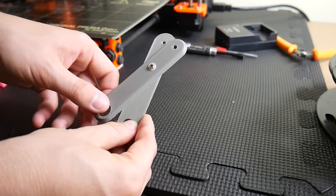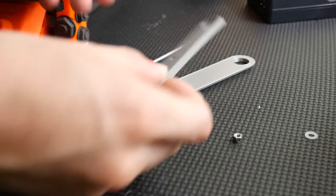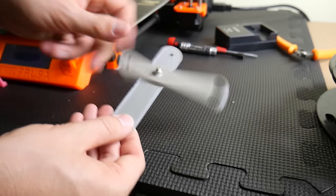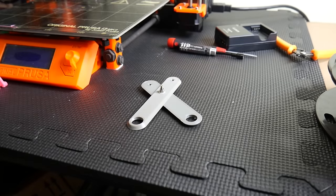The final style of hinge would be to use a fastener. Yes, I know it's cheating. But in some cases, if you have to have a very strong, long-wearing, heavy-duty hinge that has some strength to it, then you can't get away from using fasteners — and there's nothing wrong with that. Just design enough tolerance for that fastener to go in and use a nut on the other side. I recommend using a nylock nut if you can, or you can even tap it into plastic by making the receiving end of that hinge tighter and then threading a thread into it. For example, an M3 — you'd make that hole 2.5 millimeters and then tap it with an M3, or even force the screw in if you like. That's going to give you a very heavy-duty hinge, much heavier-duty than all of these print-in-place ones, but at the expense of having to add fasteners and additional hardware to your print.